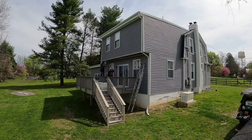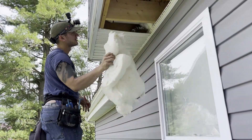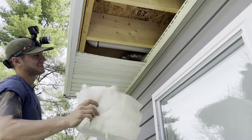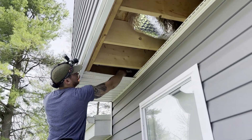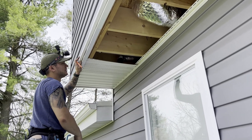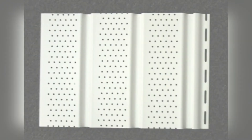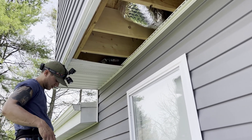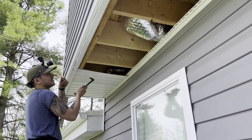I'm curious to see why is this one piece here — it's not even. Out of all the pieces, why is this one perforated? Did they just run out? That there is an exhaust — it's probably for the bathroom. That was their solution: to exhaust the fan through a vented or perforated piece of soffit. And that's just not going to work. Now we're going to figure out where that's going. If it's not moisture, it's not a huge deal. However, it's definitely not going to evacuate any kind of smell from the house — it'll make the second floor stink.